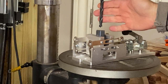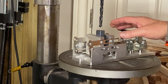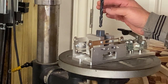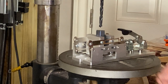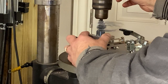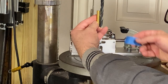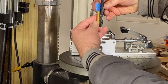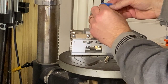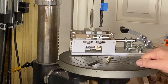I've chucked up a 3/8 inch bit. This blank is short enough that we're just going to go ahead and drill through the entire blank. On the thin red line blank, we will find the distance of the tube on our bit, mark it with a piece of tape, and drill until we hit that tape flag. We're just going to take our tube and lay it next to our drill bit, leaving a little bit of the bit passing through the bottom of the blank. I'll take my tape and make a little flag right on the bit. And now we're ready to drill.